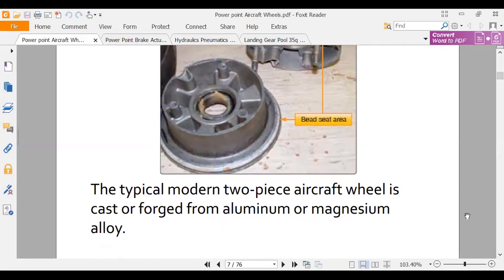Now, metal fatigue is where something bends back and forth. Like if you take a weak piece of wire, you keep bending it back and forth, eventually it'll break. Right, that's metal fatigue. So a landing gear goes through metal fatigue. As you touch down, you flex all this metal. So that axle was flexing, which is okay. But if something starts getting overstressed, the more you bend that wire back and forth, sooner or later it's going to break. And I think it was a metal fatigue issue.